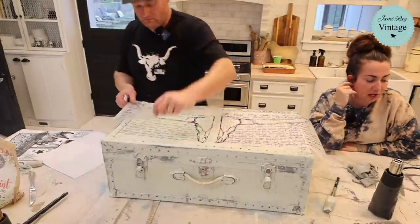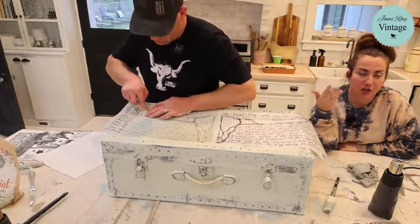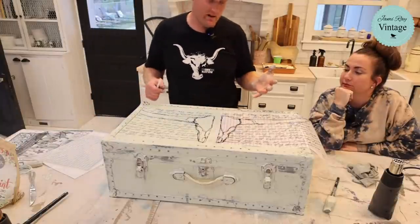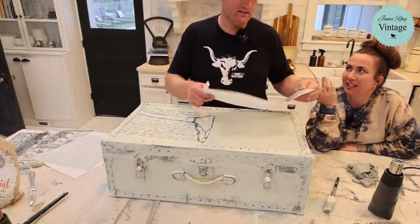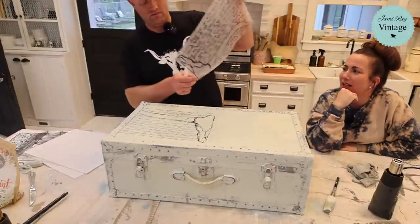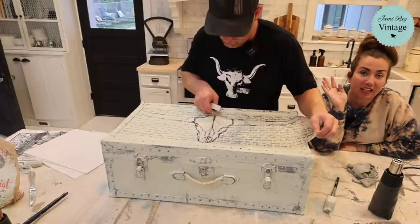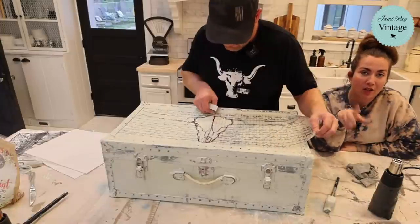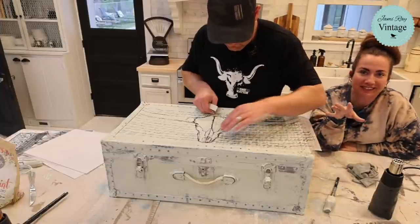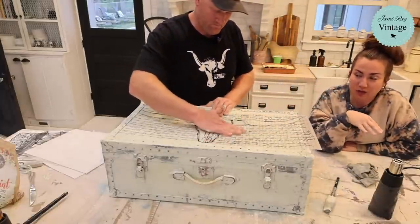Top four milk paint colors: Sweetie Jane, Pantry Door, Flower Sack, First Crush. I also really like Lantern — actually Lantern is more of a smoky grayish black. Pro tip: if you paint something in Lantern and want it very black, seal it with black oil wax or Sweet Pickens black wax — it'll make that black even richer. You can also use black wax over DIY's Little Black Dress to help that black be richer.